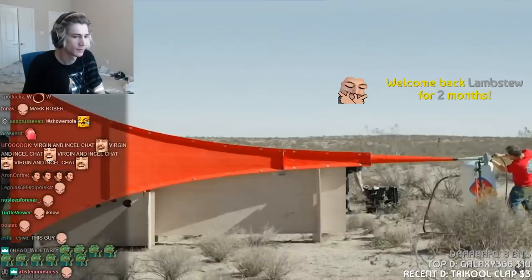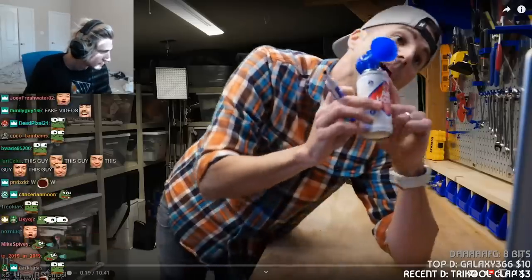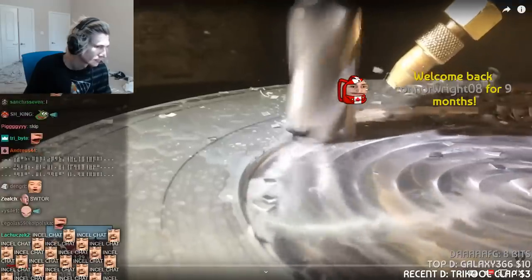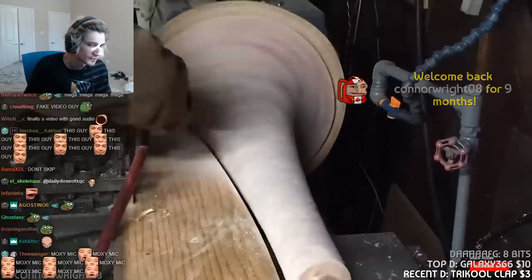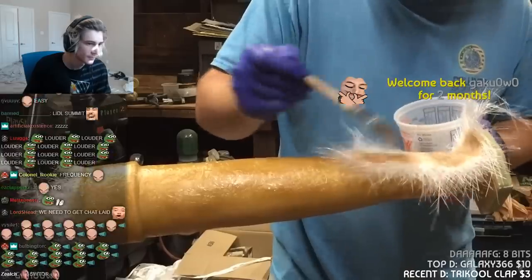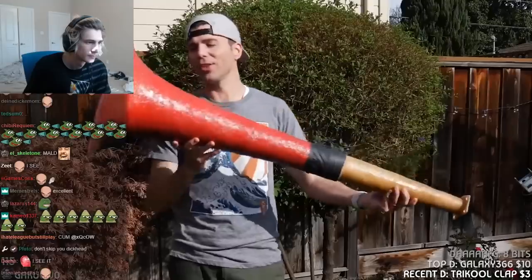I've never actually made something this big for my channel before, so as usual, we decided to make a smaller prototype model to see what we could learn about the challenges that would come from scaling it all the way up. So we started by creating a plaster mold with the right curvature, then you cover that with a gel coat, and then we put 3 layers of fiberglass and polyester resin. And then when you pop it out of the mold, you're left with this.